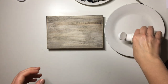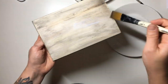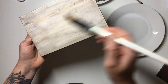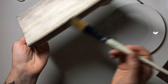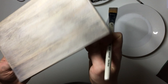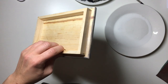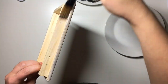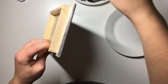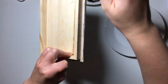This technique that I'm using is very layered — there's a lot of going backwards and forwards until you're happy with the results, and you can stop at any point that you would like. After I applied my black and sanded the excess off, I applied a few more layers of white wood stain over the top just to make it a little bit whiter again. Looking back at it now I think I should have just left it without adding extra white on top, because the top of the box ended up looking a lot whiter than the rest. So learn from my mistakes.